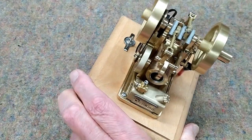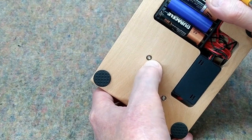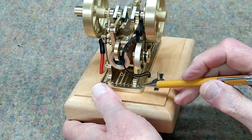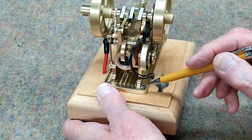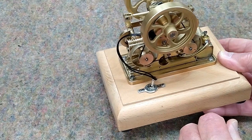When you get this engine, you want to check and make sure that the screws are tight. They are just into a nut on the hole on the other side of the wood — if loose, this could be a problem. This one in particular holds the ground strap for your ignition, so if it's not making a good connection, you may not have good ignition. Make sure you turn this off when you're not running the engine.